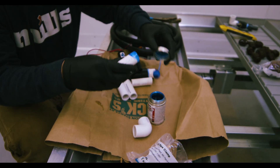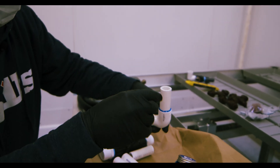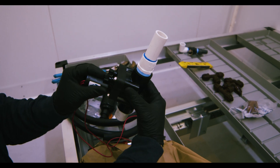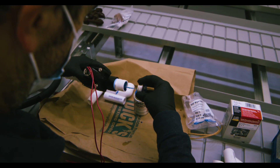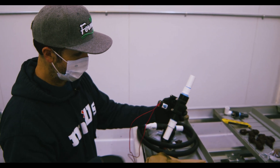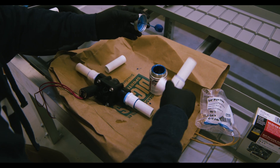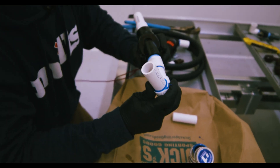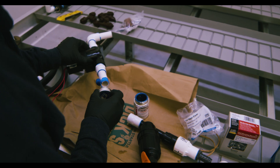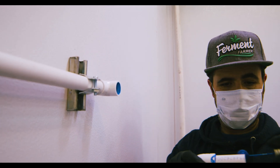Put some glue in there, a little glue right here. I'm going to very carefully put this in, spin this, and carefully let that dry. I'm just looking for that gloss to kind of come off so it'll dry. Our next glue joint — I like twisting this so you don't see the writing on the pipe. No dripping or anything, so I'm happy with that one. I'm going to come over here to the next one, hit that, carefully remove it. All these are cut to the same length, pre-cut for you, so the whole thing looks really nice and clean. Make sure you're gluing this together in the right direction so you don't have to remove it and flip them. I'm going to be methodical about how I glue this — depending on how I want to access my filter will determine how I glue this on. I want access to it on the side.